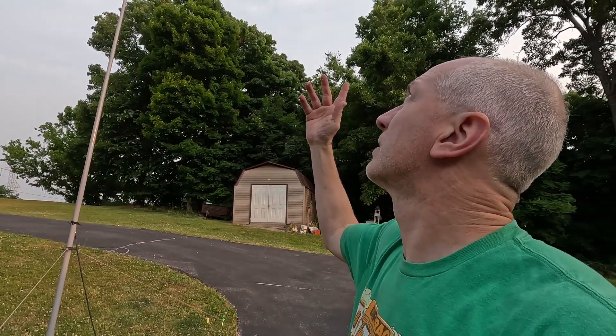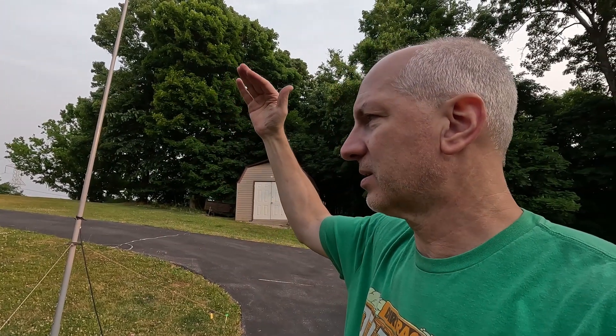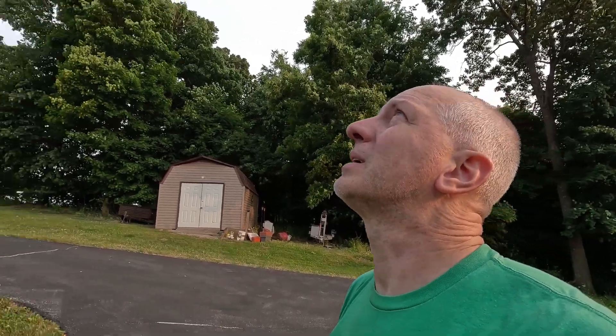It's an elevated radial with a vertical element. The buddy stick has a coil, making it a very short antenna. When you're running QRP, a compromised antenna just doesn't do you any good — it'll work, but you'll have a much harder time. If you use a full-length or quarter-wavelength antenna you'll have a lot better luck, or a 5/8-wave or something like that. I've got to tear this down and get ready for the net. Tango Oscar Mike.